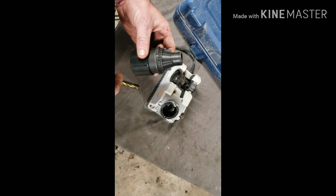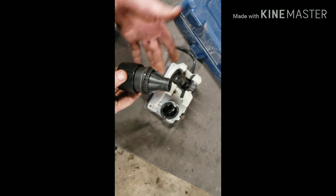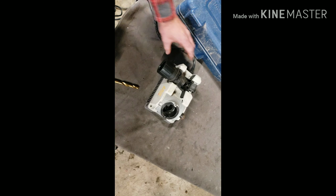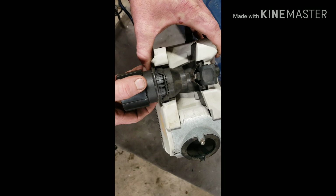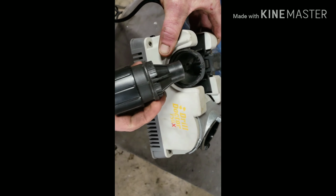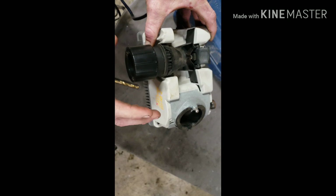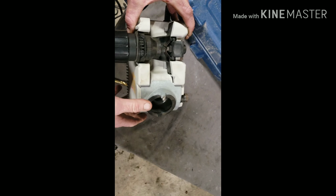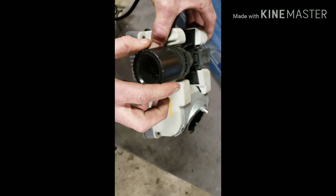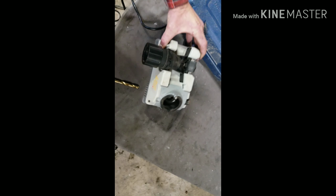So here we go. The biggest key to using a drill doctor is these notches right here. When you go to your alignment setting, see right here, we'll zoom in real quick. It says 118, it's 118 degrees. Has to do with your drill pitch. Now this is just for traditional drill bits. If you're doing something fancy, you may need to look a little further, but if you're just working with traditional drill bits, this is fine. Make sure you set it on that with the notch right there.